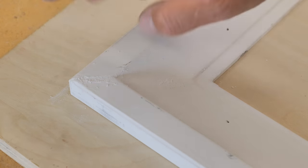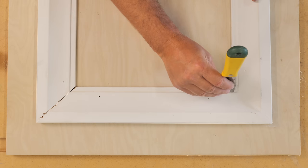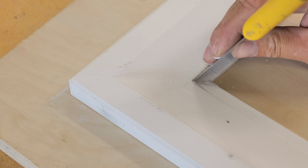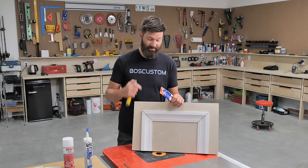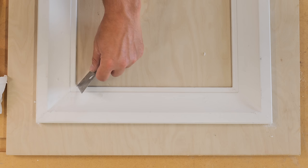You don't want to make a huge mess otherwise it's going to be a lot more sanding. If there are any tricky profiles — I have a 90-degree here — take the putty knife edge and clean out that filler a little bit before it dries, otherwise you're going to have a really difficult time sanding a perfect 90-degree corner. Now let that all build up and dry.